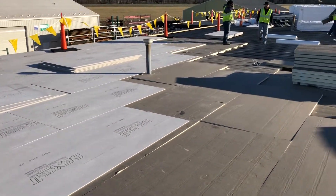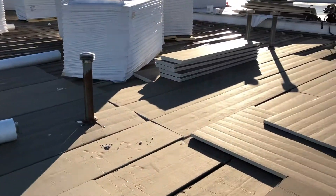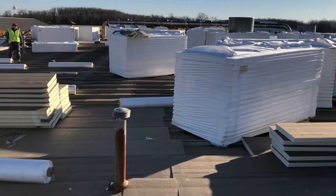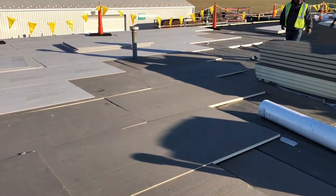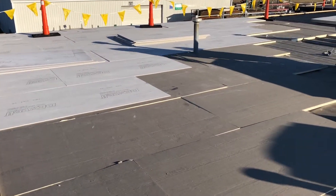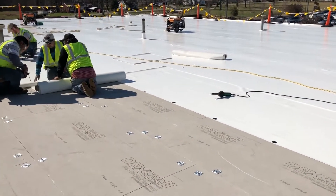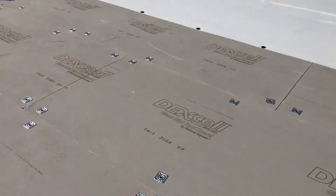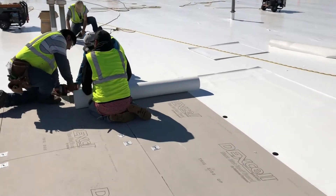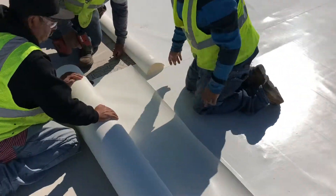After that we'll go with our membrane and turn this metal roof into a membrane roof. This is called a metal roof retrofit. With all of our insulation, we're going to retrofit this existing building with a new PVC membrane. We're back at it — got the insulation out, got the recovery board down, shot it down with screws and plates. Now these guys have kicked out the membrane and you can see it's just in rolls, rolling right out.